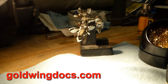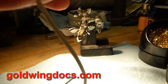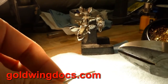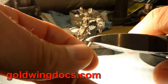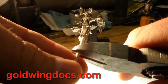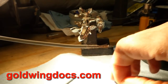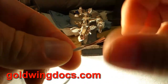I'm going to do the same thing — let me just cut a little piece off here. When it comes to stripping, I tend to eschew the actual strippers and use just diagonal cutters, because I've been using them for years. This is a technique that has taken years of use. Normally diagonal cutters just cut off the wire, but if you've done this long enough you can feel exactly how much to push into the insulation and simply strip it off. If you don't do it right it will cut some of the wire, which you don't want.